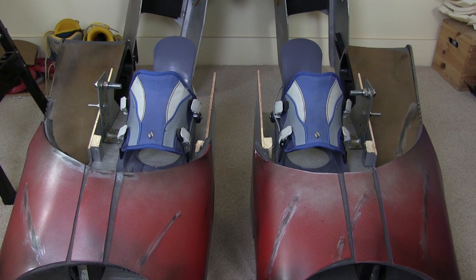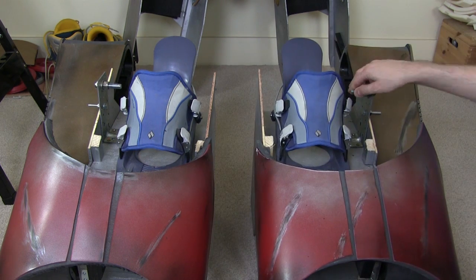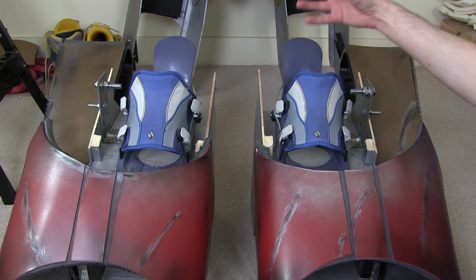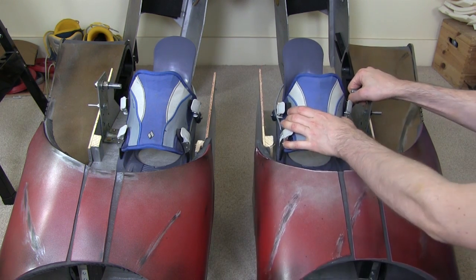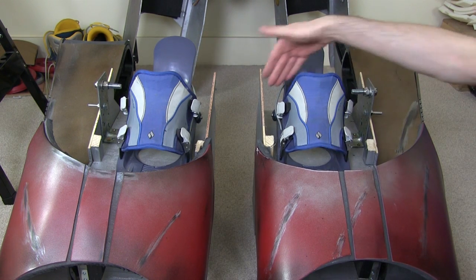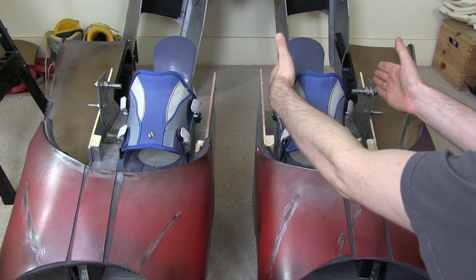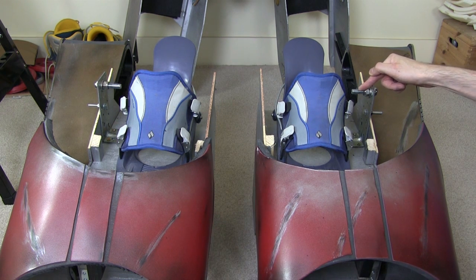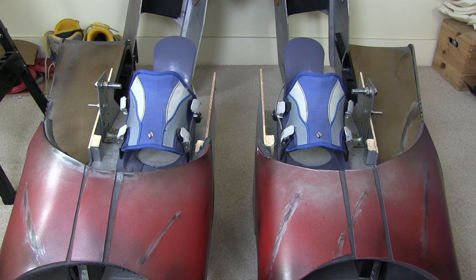As crude as it is, I think that's a pretty good solution. This is definitely strong enough to support the suit when it's standing there. I do need to sort out this tipping over issue, but for now I'm going to give it a test and try to walk in them. What I ideally want is a gimbal right in the middle here that's equally loaded on each side. The problem is my leg is in the way, so it would have to go above the toe — but that means when I pick up my leg the whole weight of the leg is pushing my toe down, which puts a lot of load on my foot. So it really needs to be around my ankle point. The leg is now displaced slightly to one side, but that's okay as it brings the feet a bit further out, stopping them banging together when I'm walking. We might have to realign the foam covers in the future.